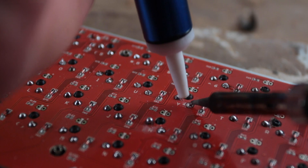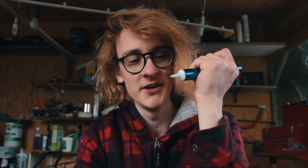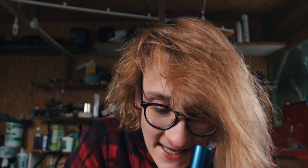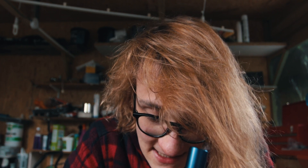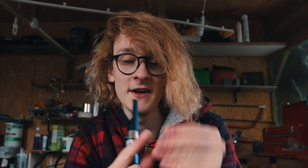Once it's nice and shiny, we can actually begin desoldering. Once it's up to heat, you just want to touch the joint with your soldering iron until it starts to turn to liquid, then just grab it with the solder sucker. Clean out your solder sucker and now you're ready to do an entire keyboard. I would recommend cleaning your soldering iron every two to three switches because the solder oxidizes the tip — just dab it on your sponge or mesh. If it doesn't come off immediately, gently heat it up again and leave it about ten seconds before trying a second time. After this, just poke your switch through using something blunt, and there we have it — one desoldered switch.